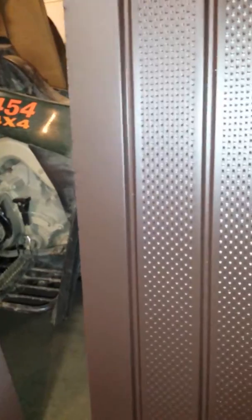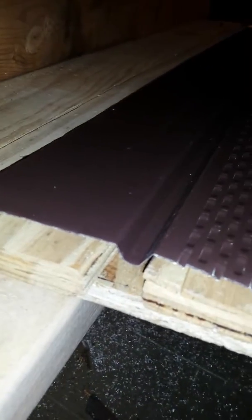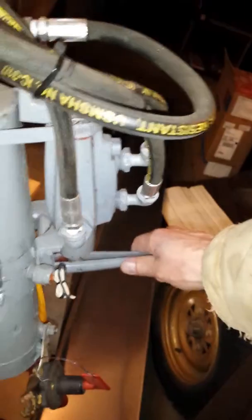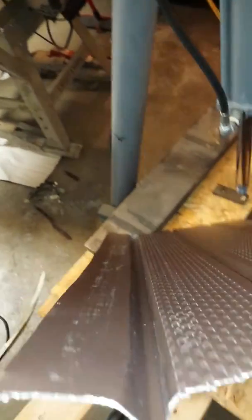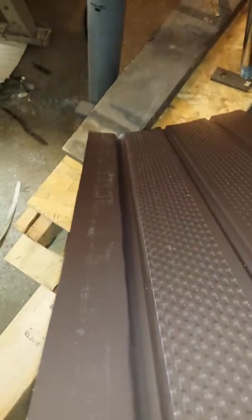So I'll grab a sheet here. It's only a two-handle process. Align the groove — I can do it on the far side. Bring her down. Turn on the pump here and we'll start the press. We've got a groove. The very ends don't go quite as well, but it's soft enough that you can form it by hand. So there it is.